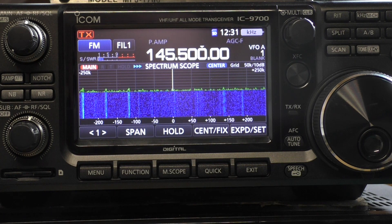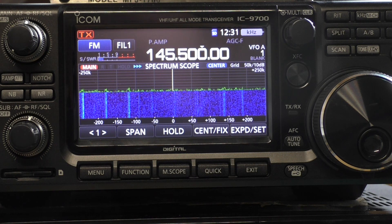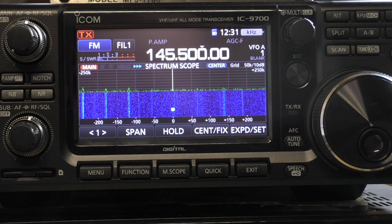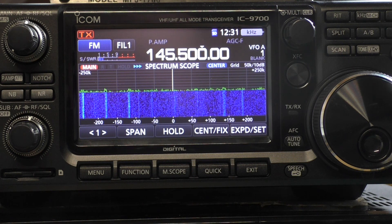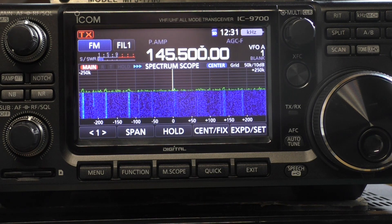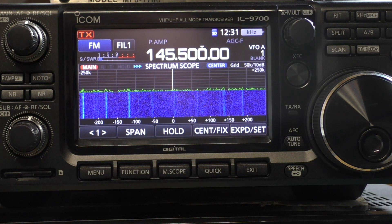Effectively all you're going to gain is an extra 2MHz, so you'll be able to go up from 146 to 148MHz on the 2m band, which is quite useful because with the right variation on your license you can use between 146 and 147MHz in the UK.